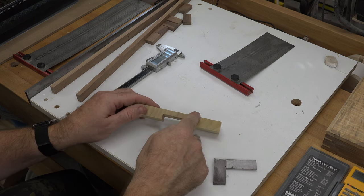Well, we can put those pieces aside and we want to work now on this battery box. Guys, this looks a little tricky, but if you take it step by step, you'll be all right. And as I've said, do as many cuts as you can while your piece is intact. So what we want to do for starters is we want to cut this rabbet that's right here. Now that rabbet measures 5/16 deep